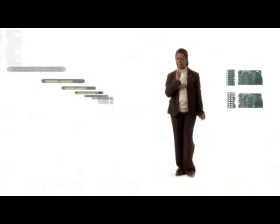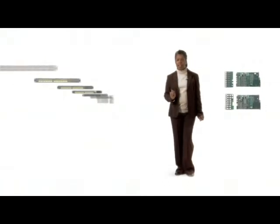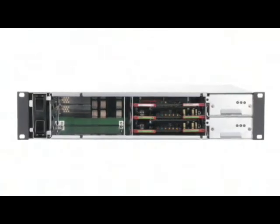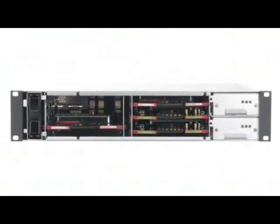But wait, I could make some savings here. Since I only have 2 AES signals, I could use the empty ports on my Cat5 panel client card. Why? Because at Riedel, all signals between a frame and a panel are pure AES3 signals. That means you can also send panel data over digital audio routers. Seems like the wonks on the top floor had some pretty smart ideas.